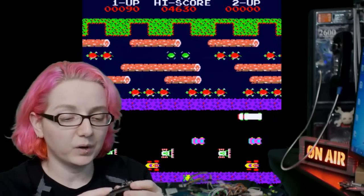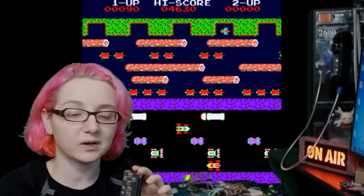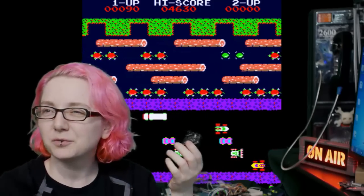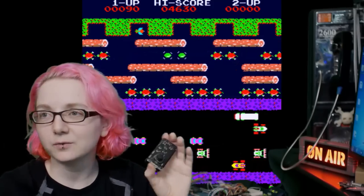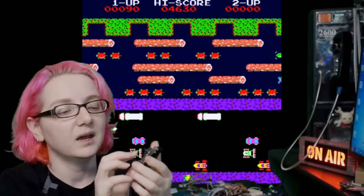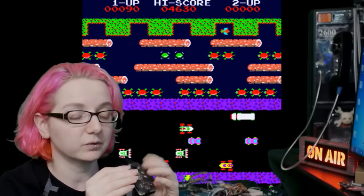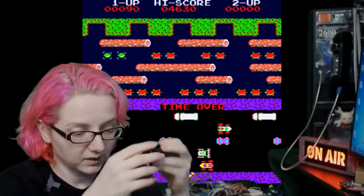And then I'll probably just send it off. What I really like about this design is how simple it is. There's not a lot of hardware going on. There's no drivers really. Other than that I2C converter, it's pretty much just GPIO pins and that Raspberry Pi module. But that works pretty well. So that's kind of what I'm working on.